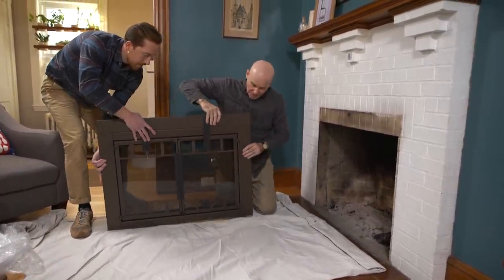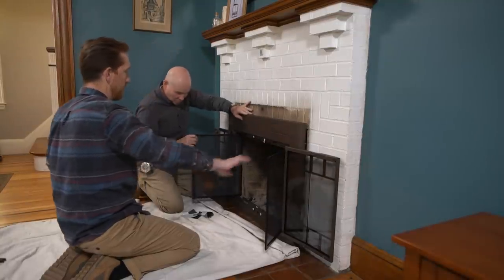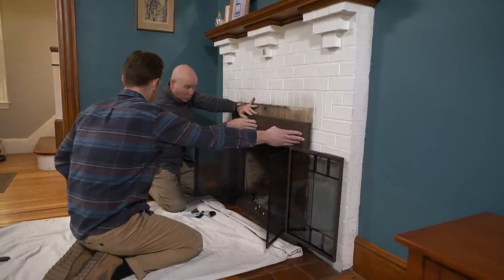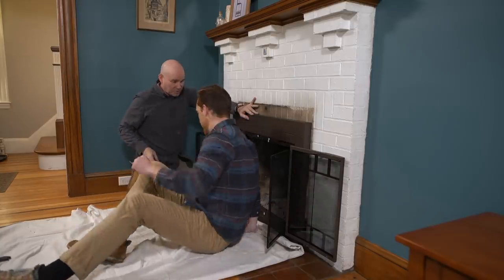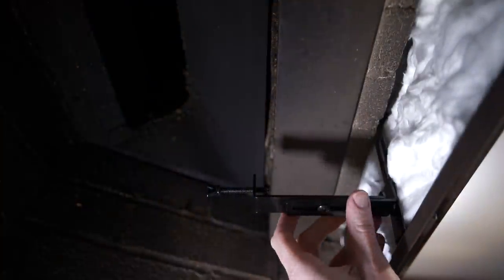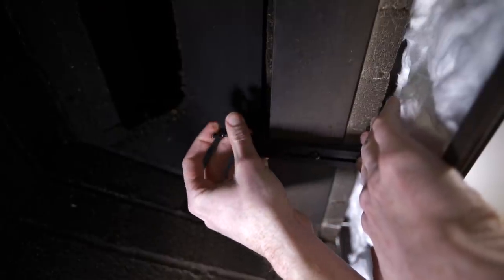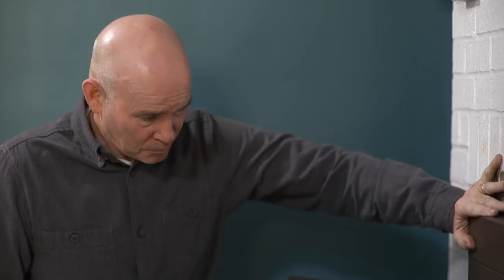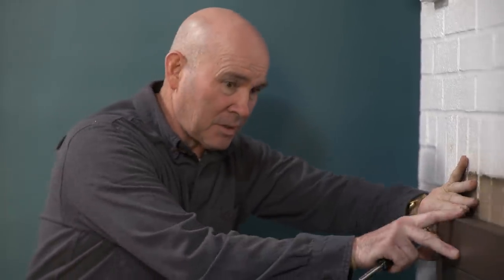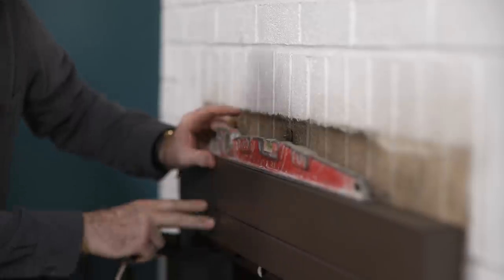Watch that glass. Now we're just going to twist it in. If you want to dive in there, I'll hold the door in place and you can start with the clips. Now this is the T-bracket — make sure it wraps around that lintel, which is that piece of steel that's right above you. Should be good. We'll throw the level on it. It doesn't get much better than that.